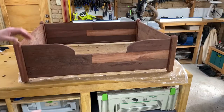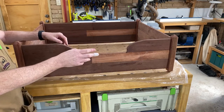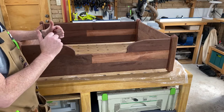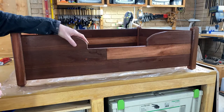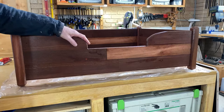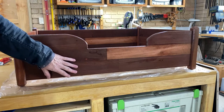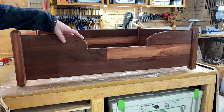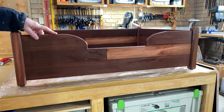We still have a little leg to go on the bottom in the middle so this doesn't bend. Now at the final point - I've just got to give it its final sanding, remove any assembly marks, and when it's all looking pretty schmick I'm going to give it a few coats of water-based polyurethane. The bed is very nearly finished now - I've put on three thin coats which have gone on nicely, with a light sand between each coat. I could give it a final 400-grit sand and wax it, but I don't want my dog to chew on it - my waxes contain beeswax and other things he'd love the smell of, so I'll leave it as plain polyurethane.